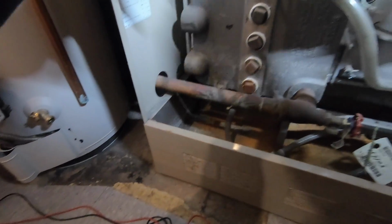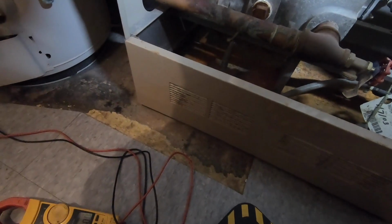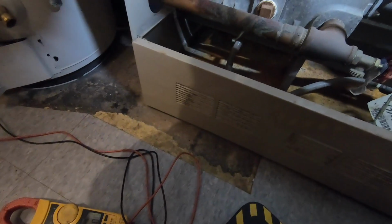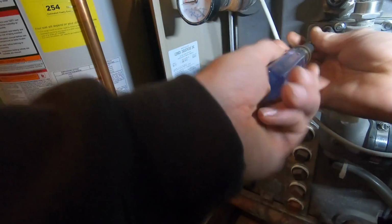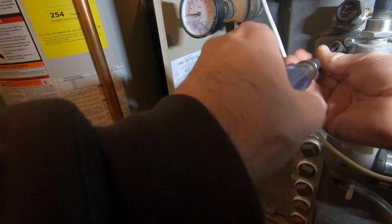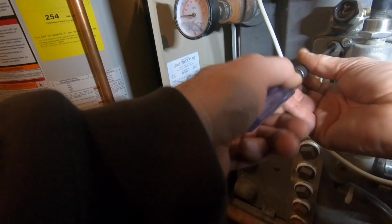And you keep these in the truck, right? No. No. They're not in my truck. But it's broken. I could tell already without taking it out. But that's why. I don't have continuity or resistance going through it. I have an open line, which means the coil is broken.